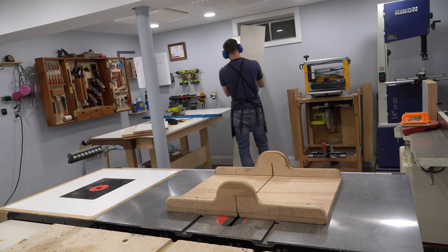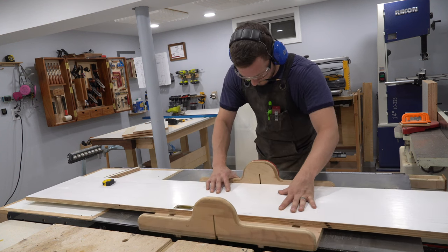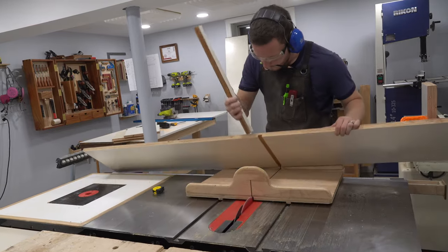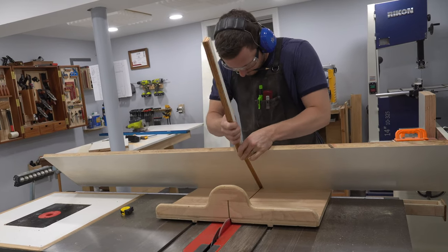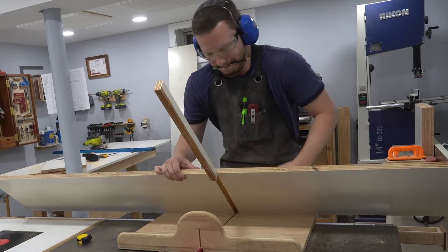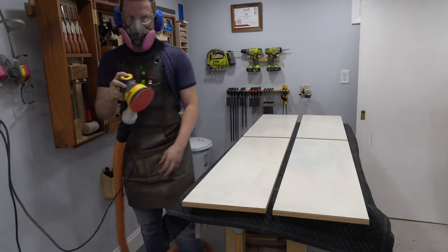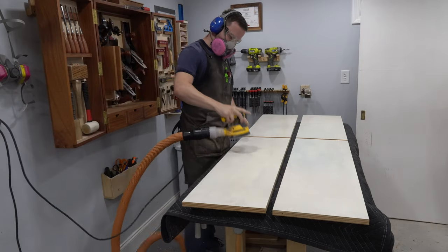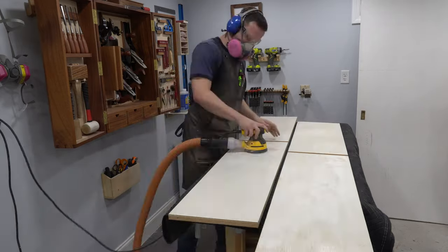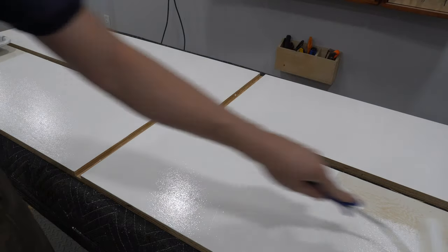While I want the shelves to be adjustable, I decided at least one shelf should be glued in place to improve the structural stability of the unit. Eventually, the clothing rod will be attached to the side of the shelves so this middle shelf will help counteract some of the shear forces. To cut the dado for this middle shelf, I took several passes with my normal kerf saw blade because it's definitely way faster than installing a dado blade stack for just one shelf. I got really excited about this perfect fit — I could tell this was going to go a long way towards erecting a really stiff shelf. The old paint on the closet doors was oil-based and I was about to apply latex-based paint, so I sanded the hell out of them before priming and painting. Painting the shelves at this point actually ended up causing a problem down the road, which I'll get to in a minute.